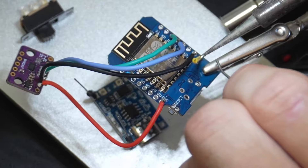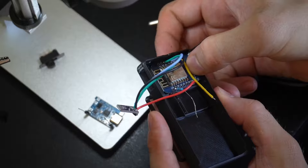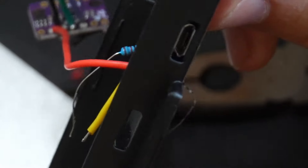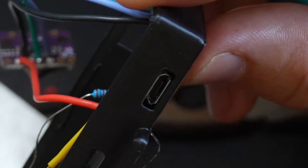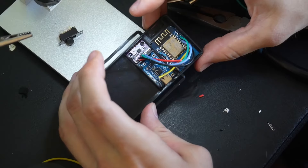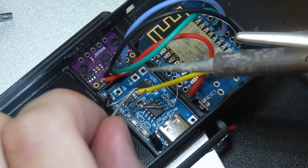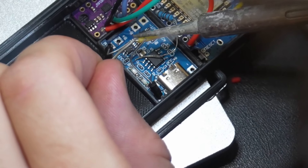Next, I'm going to measure the 5v wire that's going to go from our control board and connect to our diodes on our charger board. Connecting to our 5v, I'm then going to put everything in the case for the final time. A little pro tip on putting these in: you want to line up the back first and then push it in. This way our micro USB and our Type-C will line up with the holes on the 3D printed case. I'm now going to attach the 5v wire to both diodes.